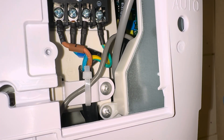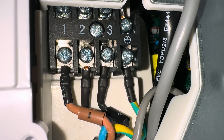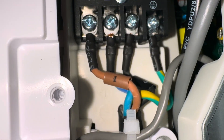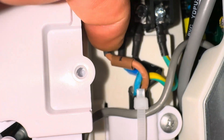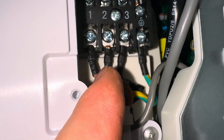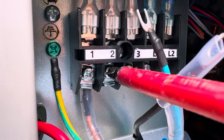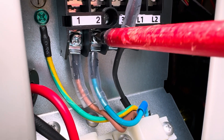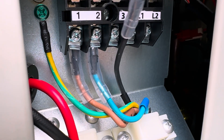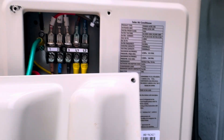Wiring is really simple — it couldn't be any easier. On the inside unit, make sure the cable clamp is holding down the wires, then connect one, two, and three, and of course connect ground, then put the wire cover back over. On the outdoor unit you do the exact same thing: ground, one, two, and three. That's it for connecting the indoor unit to the outdoor unit.